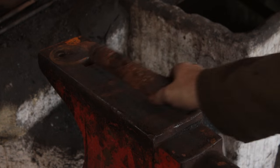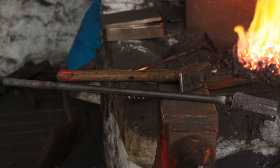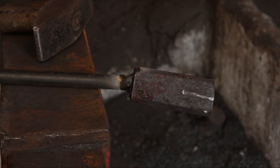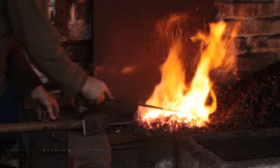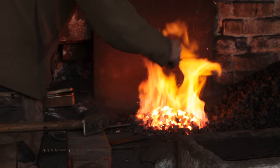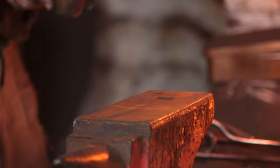This is the material which is going to become the drift. It's a 40 mil roundish piece — it's probably wrought iron, a big old lump of scrap I've had around for ages. I cut the end off and welded it to a rod to make it easier to handle. I'll stick it in the fire and start tapering it, making sure it's nice and clean first.